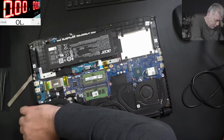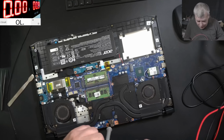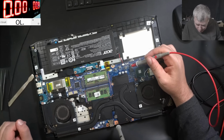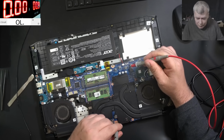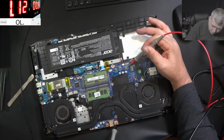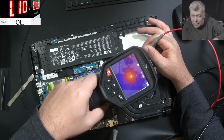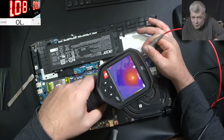Let me power up the thermal camera. We have 0.9. I just finished another Acer laptop, same with the RTX. So we can have a look together. 0.9 coming on this coil. Yeah, right? Ground. Come on, ground. Yeah, he's taking 1 amp. And check that, check that the chipset is hot in one corner. You can see it? Yeah, I'll take a nice picture and I'll send it to the customer.